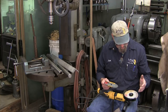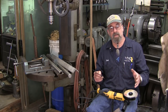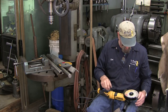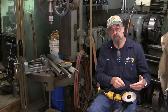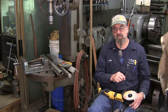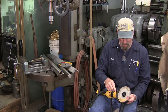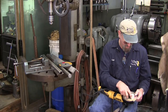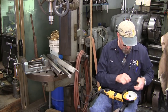Now we're gonna change out our blades here. Both the 8953L and 8953F can cut stainless steel, but the F is preferred for being a little more serious on cutting the stainless, and that's what we're going to change this into. Now I tightened this on by hand. I showed you that through use, torque, and heat, a lot of times the nuts will tighten up tighter than you can release them by hand, and when it releases by hand, sometimes it comes loose really fast, and you can come up with a nick or scratch needlessly. Using the wrench is the best way to break that loose. Let's set our wrench off to the side, and we'll put on the new blade here.